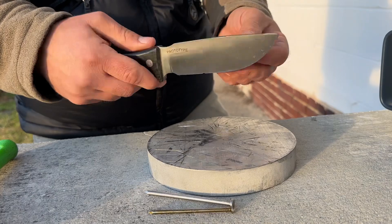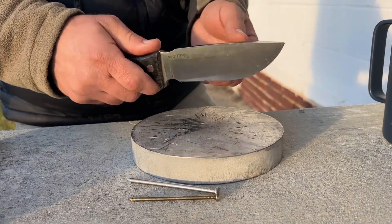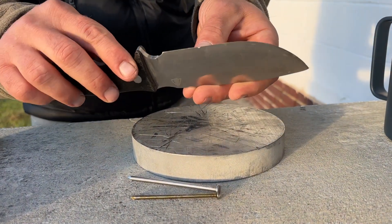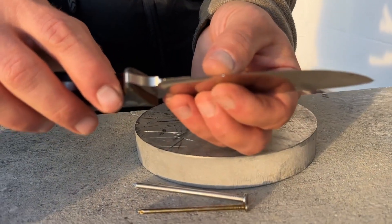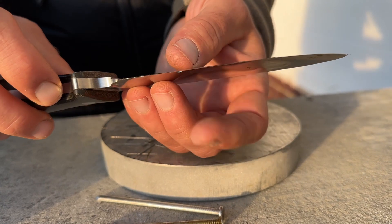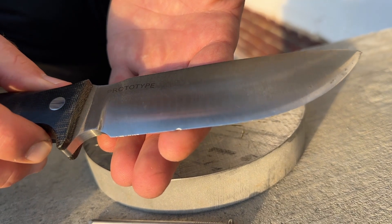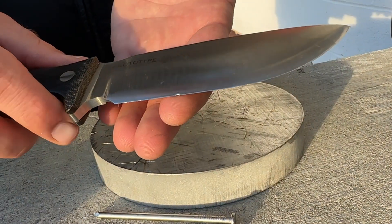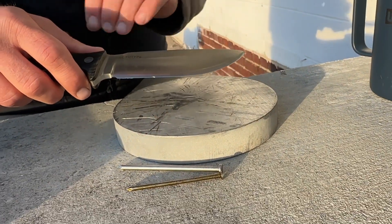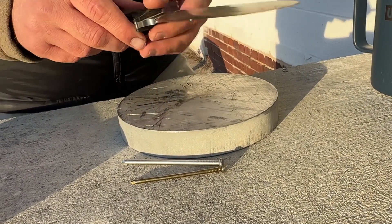This is a gross abuse test to illustrate some of the strengths and weaknesses of these different materials. Sean gave it to me, and it's going to break my heart a little because it's the only prototype I think I've ever had. But I just want to illustrate here — you can already see, this is an ongoing thing. It just folded. It didn't crush — it folded. And that's due to the transverse toughness disparity. It's not magic. I can make knives and create circumstances where these steels look like they do amazing at certain things, or I can just be honest and show you relative information, and that's what I'm here to do.